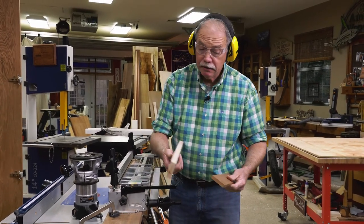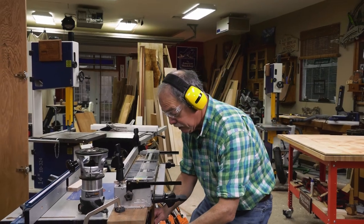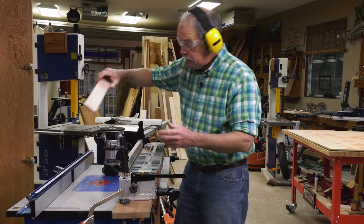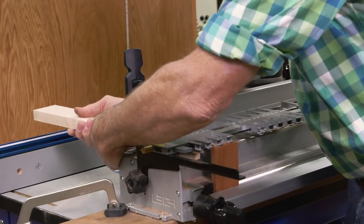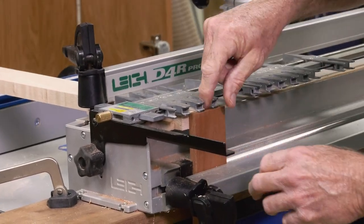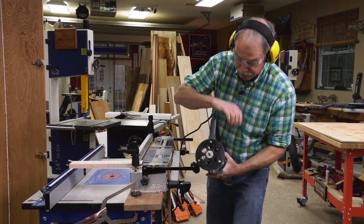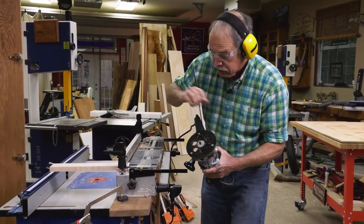Here's a half-inch piece of mahogany and a three-quarter-inch thick piece of bird's eye maple — these will become the dovetails. I'm using a jig to slide the dovetail piece with best face in — that's important, you want the best grain showing. On this piece of bird's eye, best face is down, because this will cut the pin sockets for the dovetails. There are stops that align everything perfectly. I use a 14-degree dovetail bit, half an inch wide, and that bushing follows these fingers — let me show you what I'm talking about.